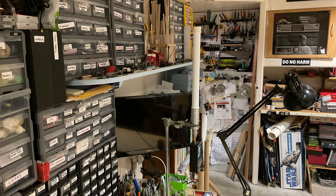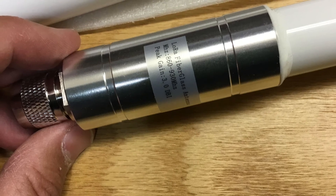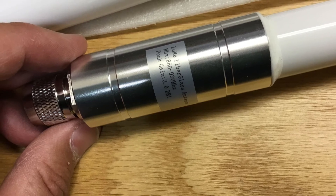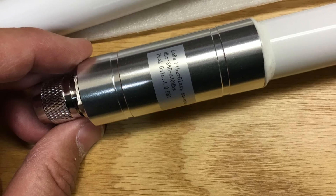To ensure there wasn't some unknown error associated with the outdoor test on the smaller antenna, I disassembled the setup, rebuilt it, tested it a few more times outdoors, and even tried moving the setup to my shop to see if there was some other environmental factor impacting performance. My shop did yield marginally better results, but the VSWR remained above 2, which is a threshold commonly considered a minimum standard for antenna performance. The overall build and fiberglass case makes this a really nice antenna, so I plan on opening it up at a later date to see if I can tune it myself with the Vector Impedance Analyzer — perhaps something I can share in a future video.